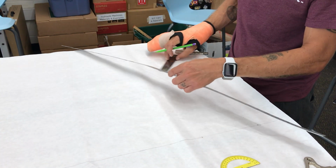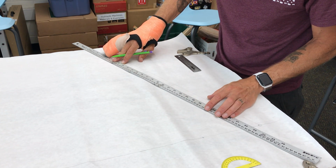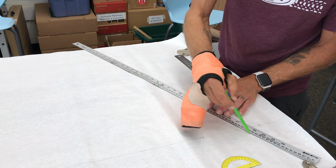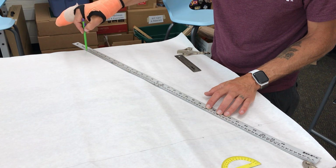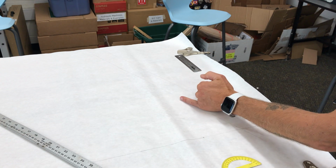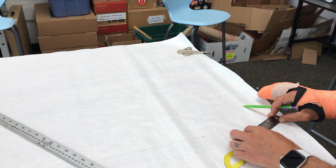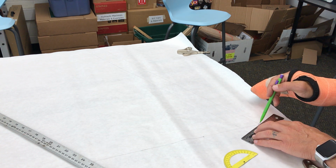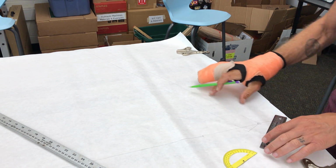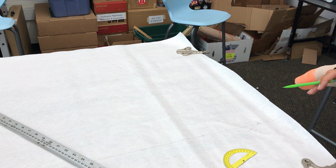And if I measure it accurately, this other line that is offset should have that same 67.7 angle. I'm again going to draw kind of lightly, and pretty long on this one. All right? So that's actually the head tube angle, and this distance from the front axle to that is your offset here, head tube angle here, and this is kind of just another line that we were using to find our head tube angle.